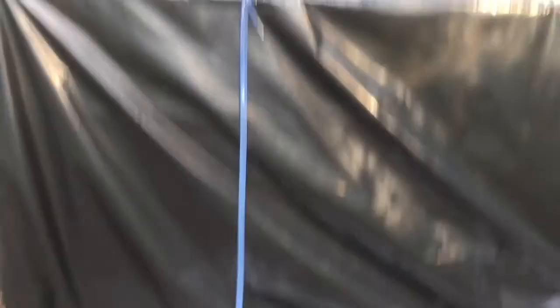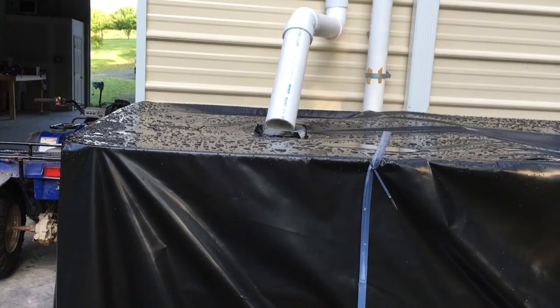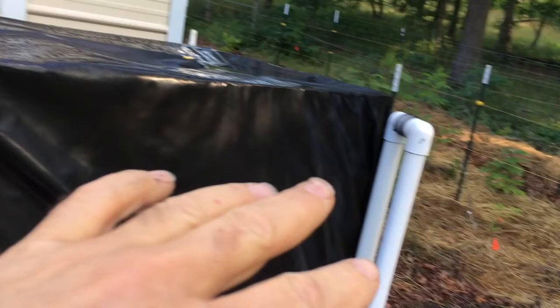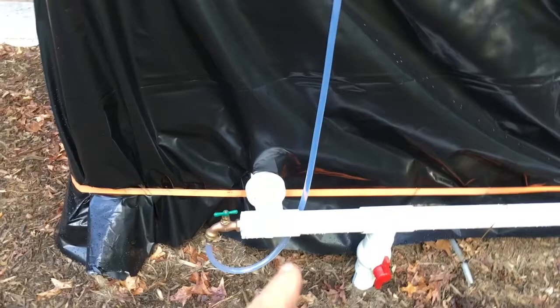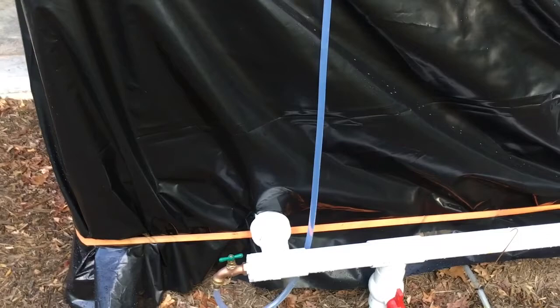The reason I want to do this is that with all the water coming in during a heavy downpour — and we've had a lot of them this year — the overflow system can't handle all the water, and we end up dumping water right by the garage. I want to compensate for that and get as much water out as I can. I'm limited by the two-inch pipes here, but when I add them together I could get away with three-inch, but I'm going to do four-inch anyway.